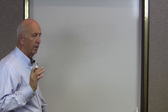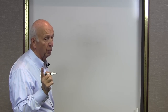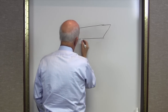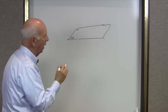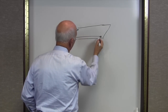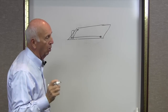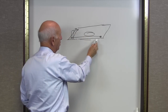We're going to check with our dial indicator. Remember, there are a couple of challenges — we want to make sure we understand the dynamics of what's going on. Our surface plate is here. First thing we're going to do is check corner to corner. If we check this corner and put our height gauge here, then check this corner and come over here and check that corner — more than likely, the corners are probably good, from corner to corner to corner.